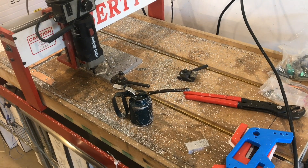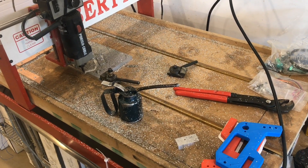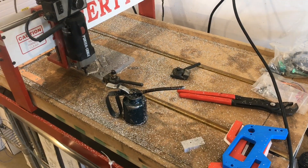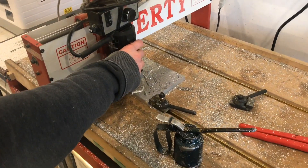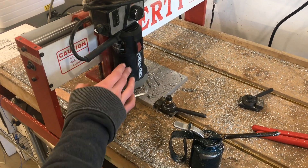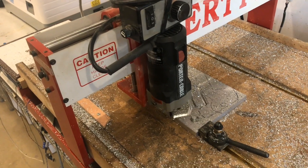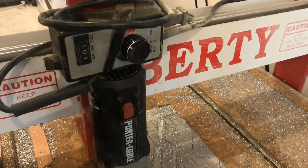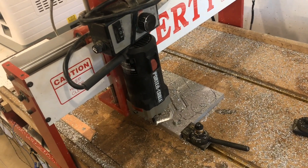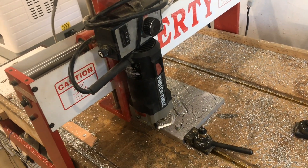It's a good goal to try to do, but there are challenges because even though aluminum is one of the softer metals, routers are made more for wood and the spindle is designed to spin much, much faster than what you normally cut metal with. This spindle spins probably in the range of 10,000 to 20,000 RPM. And on a really low setting, if you do have a speed controller, you might be able to take it down to five thousand. But the problem with reducing the speed is that, unlike a regular mill, in order to reduce the speed it reduces the power delivered to the motor.